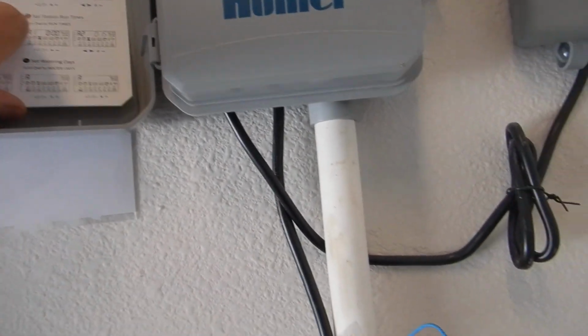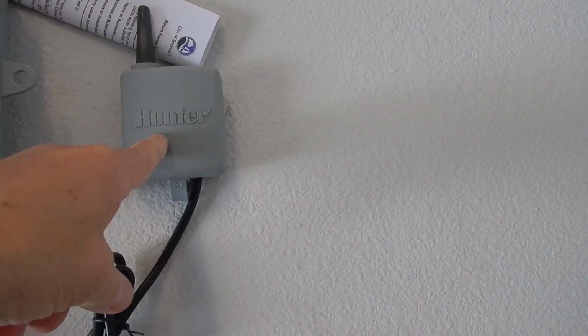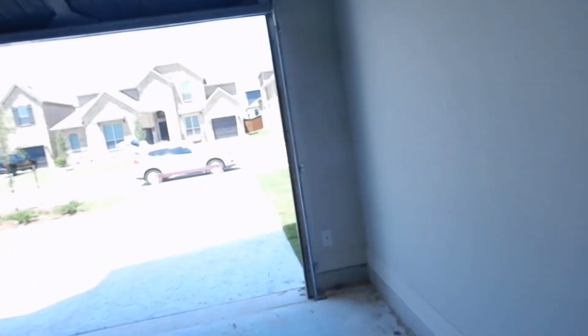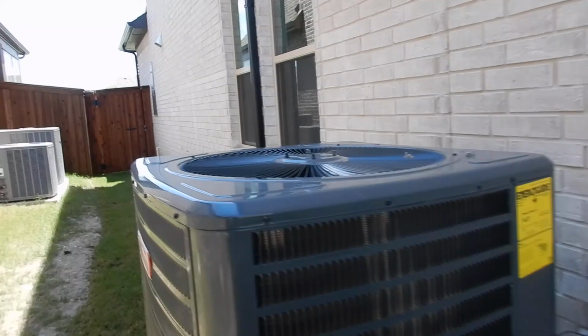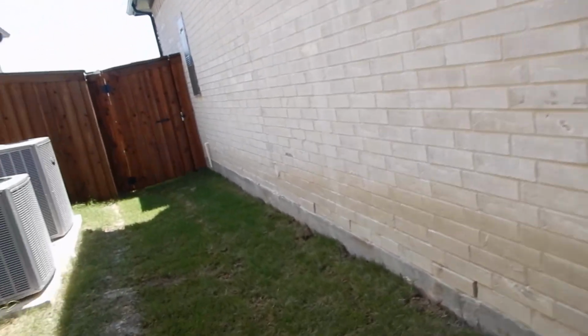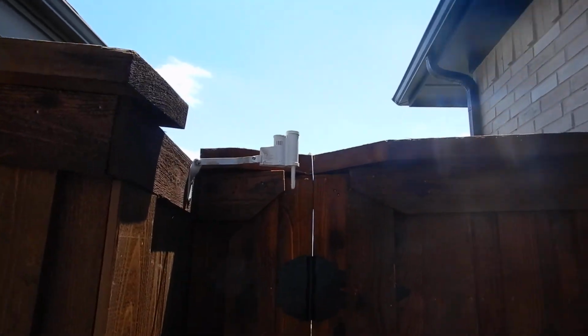So, speaking of not having instructions, this is the lawn sprinkler system. We're not actually going to have a video about that, but the zones are labeled. How about that? We have operation instructions. Building permit. It's pretty easy to figure out. Your backflow prevention has been checked. Got some documentation here. This is your rain sensor receiver, your weather sensor, so it doesn't operate in the wintertime or when it's freezing, or when it's raining. And coming along, we're on the east side of the house. That's the east garage, the smaller east garage, on the east wall. That's where the control was. And then over here on the fence, oh, we got another water heater. Look at that. Over here on the fence, there is our weather sensor.